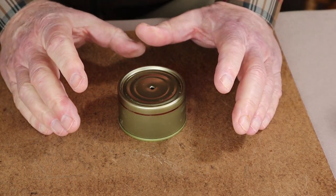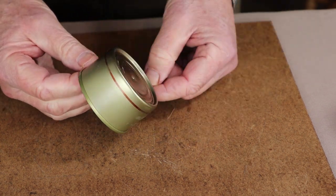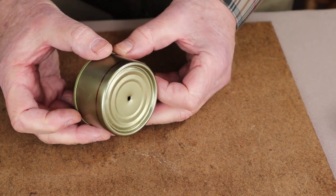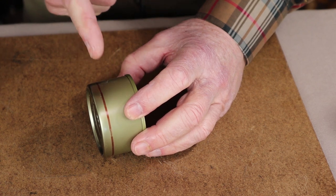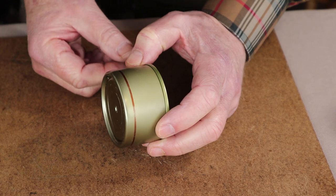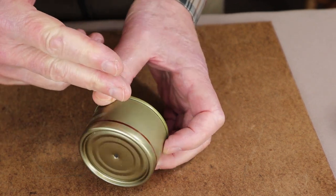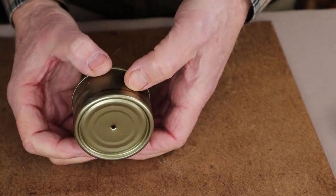From here there are a couple of methods for cutting out the hole at the size you want as well as cutting off the outside. If you don't have the tools I'm going to use, there are other ways: with patience you can use a hacksaw and cut your way around — it works, though the hardest part is getting started until you make the first entry through the metal. Easier than that would be a Dremel tool with a cutoff wheel. You can even use metal shears and just come in from the side and work your way down to the line — metal shears will cut this quite easily since the metal is quite thin.